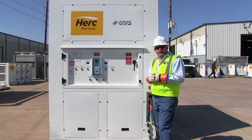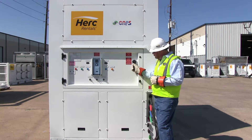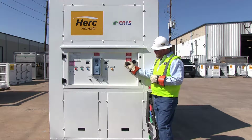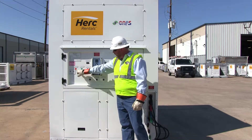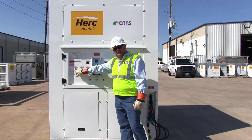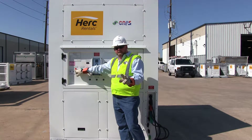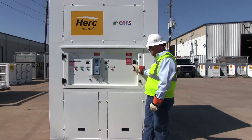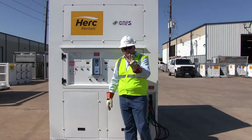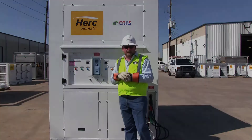We've energized our main power feed. Now we have a local breaker here — we're going to close the breaker, that starts it up. Notice that we have a power light which is illuminated, but we also have a phase incorrect light that's on. This indicates that two of our phases are not properly phased. So we're going to disconnect the power at the main breaker, lock and tag out our main power source, and reverse two cables.